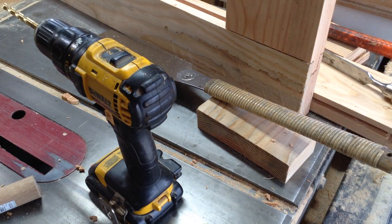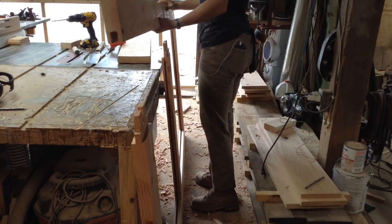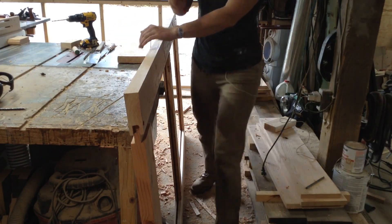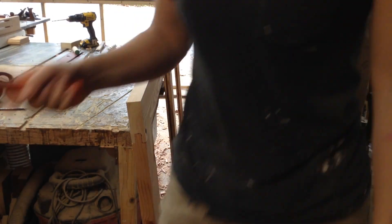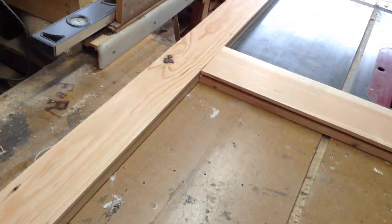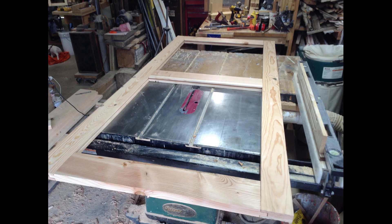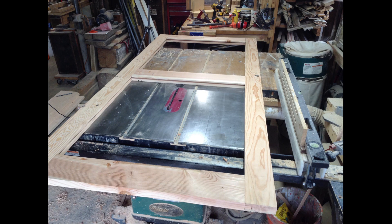It's a nice snug fit — I don't have to pound on it too much, but it takes some force to get it into place. I cut those tenons on all the pieces identically, then dry fit the whole frame together. In the first dry fit there are some hairline gaps, so I went through all the joints and cleaned them up until everything fits snug and flush. By the time I glued this together, those gaps had disappeared. You can also see that inner perimeter — the dado goes around the whole thing — which means the panels will sit in there flush.